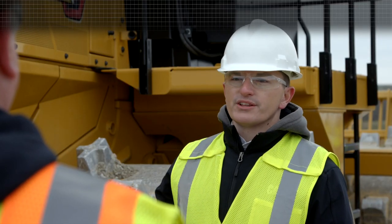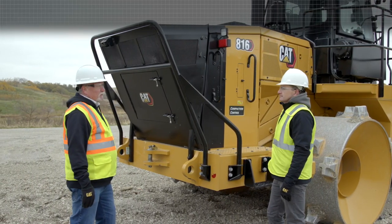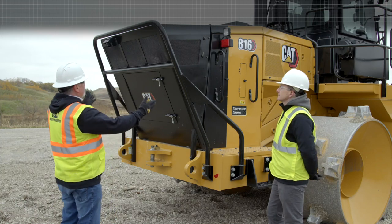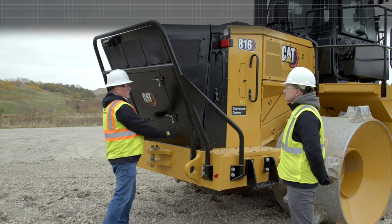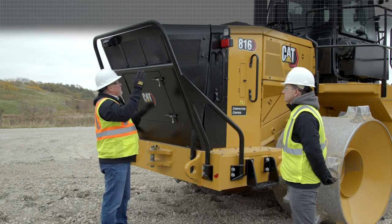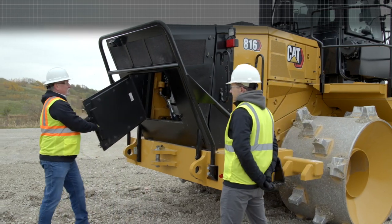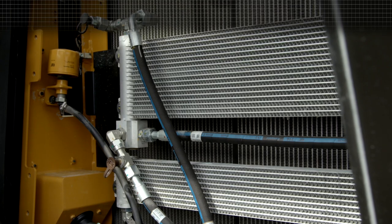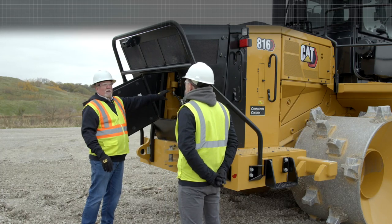As we move to the rear of the machine, let's talk about our cooling package. The cooling package is totally different than most heavy equipment Caterpillar produces — it is a waste-resistant cooling package. To start with, we have the scoop, because we bring air in but we don't want to bring fresh air in down low. So we scoop it out and put the screens up on top to bring the air in as high and as fresh as possible. Enclosed in here we have our cores. We open up this hinged door for very easy access — you can see all the cores are six fins per inch, which means they're wide spaced, so if dust can get through the screen, it can actually go through the radiator core without plugging it up.